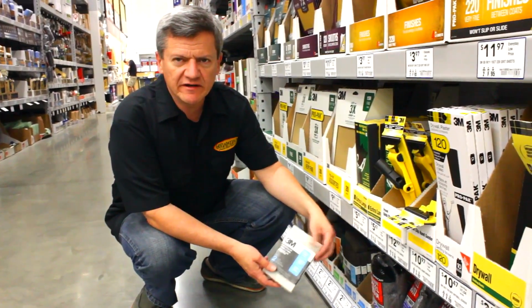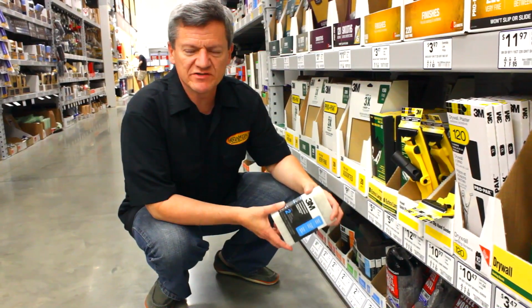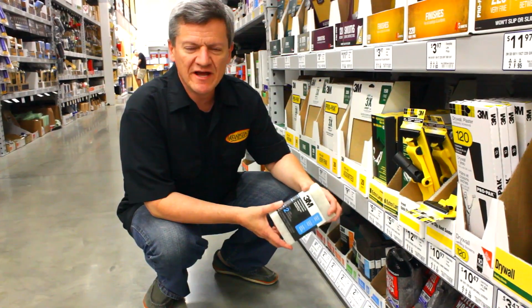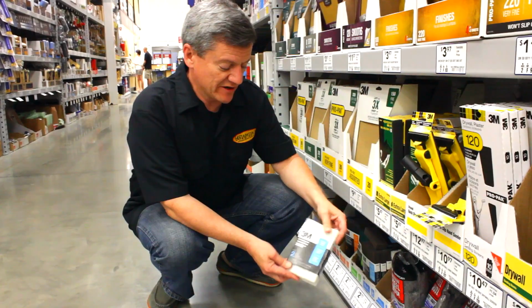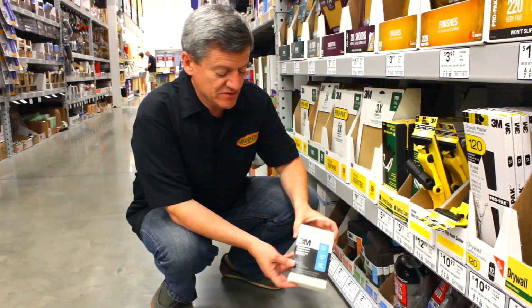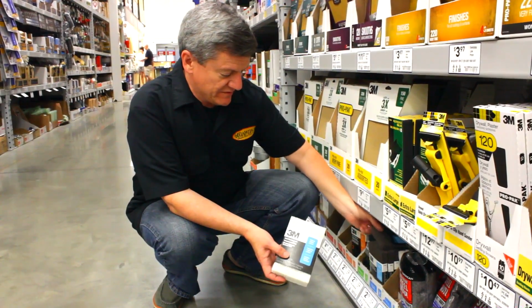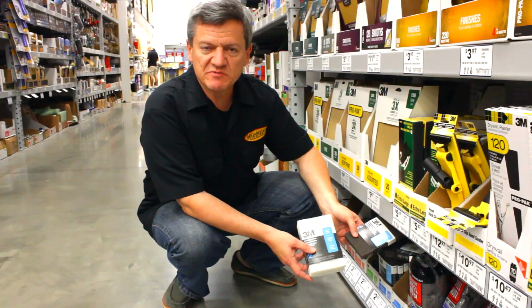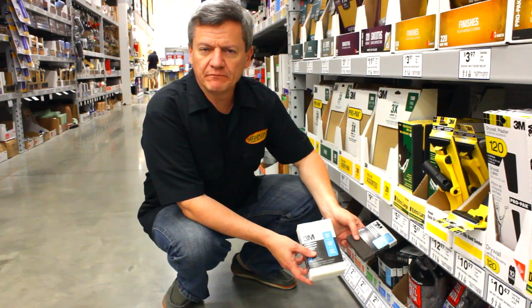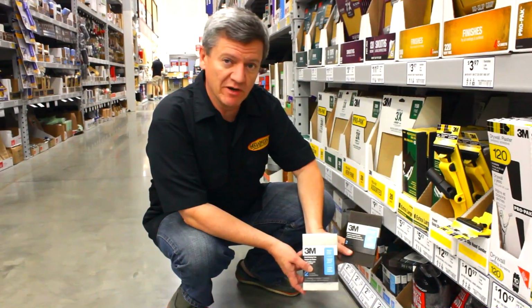One thing you're going to find is a lot of people use steel wool on guitars, and I recommend you don't, because the steel sheds from steel wool and it sticks to your pickups and you can never hardly get it off. So I recommend these white pads from 3M. They're called finishing pads, and the gray ones also. They are fantastic replacements for steel wool, and I really like to use them both on my guitars.